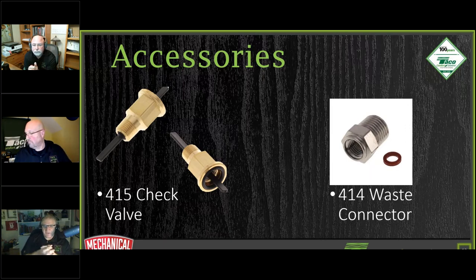Patrick S. asks, can they be purchased by the truckload? Patrick, if you order them by the truckload, we'll send them to you by the truckload, brother. That's an easy one. In a multi-story, can these suck in air? Yes, they can, but see, this is an air letter outer, but you change some system dynamics, it turns into an air letter inner. It's a dandy air letter inner. In the parlance, it can be an air admittance valve.